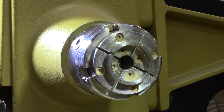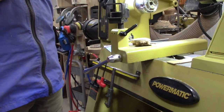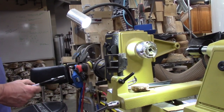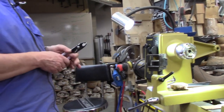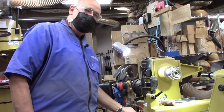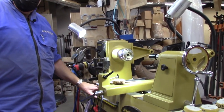I keep a magnet here with the wrench for the chuck and the wrench for the cold jaws. One of my favorite tools: soft-jaw pliers. At my age a lot of smaller screws I don't have the strength to get tight enough — particularly all the blade adjustments on the Powermatic bandsaw, which will just come undone. With these I can quickly tighten something without scoring it up like regular pliers would. I use them to get the chuck on and off.